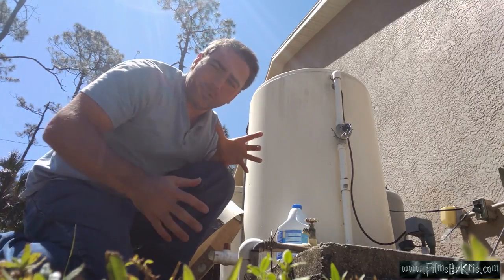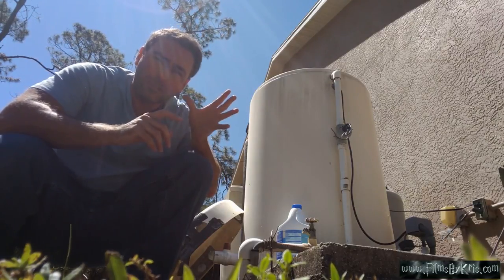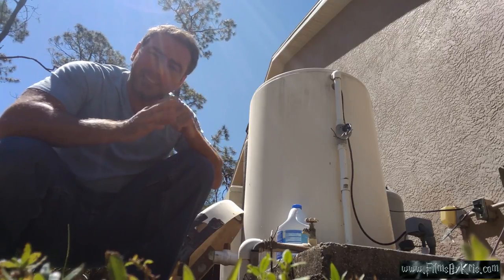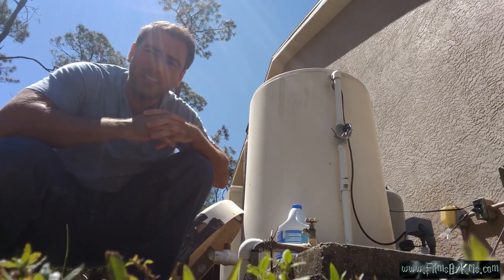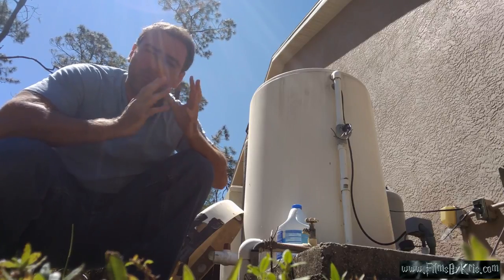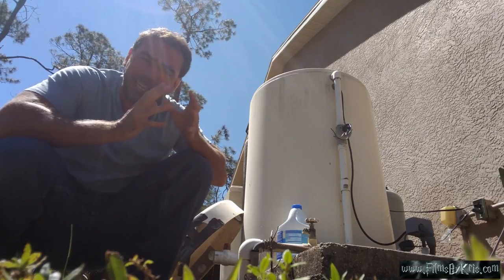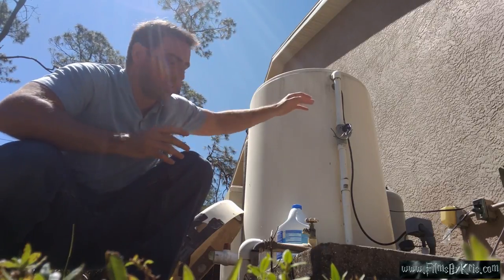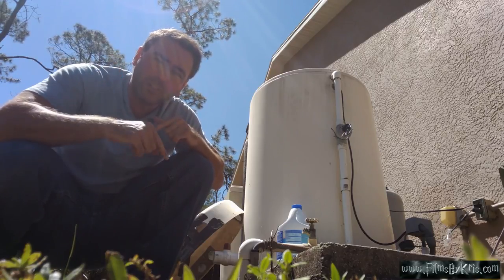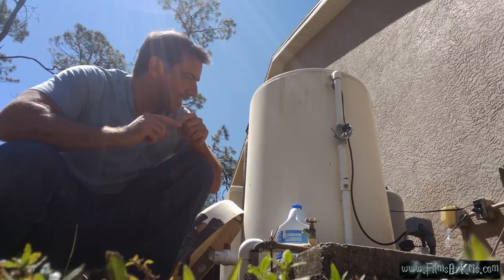Last time this happened with the bladder valve problem, I decided I was going to hook up an ESP that will alert me when it's been running for more than five minutes. I programmed it so it hooks to my Wi-Fi, sends a signal to a log so I can track when the pump is turning on and off. If it runs for more than five minutes — because it shouldn't run for more than a minute or two — it hits another URL which is going to send me a text message.